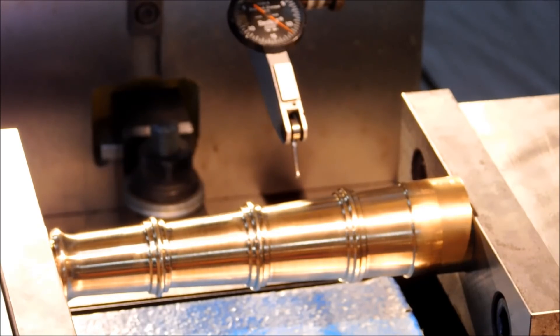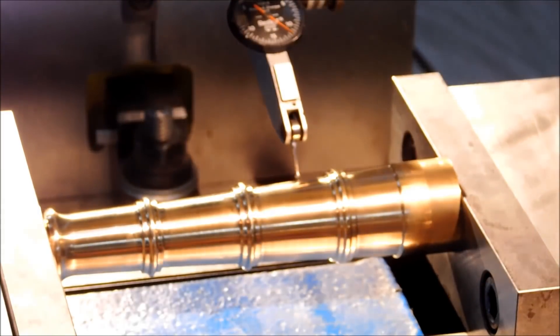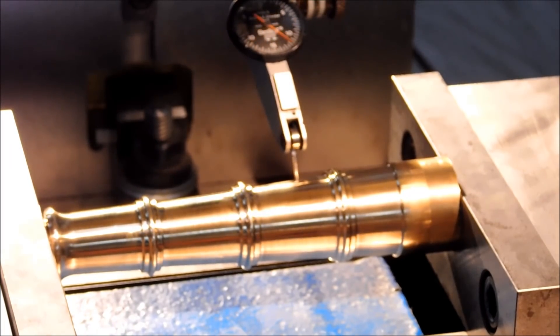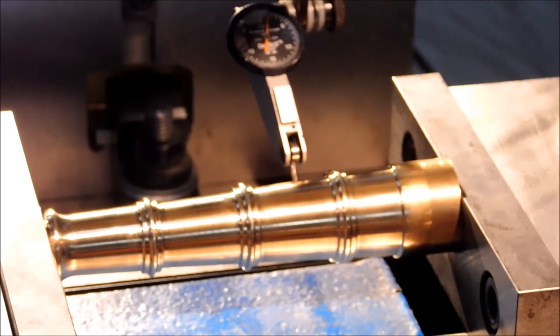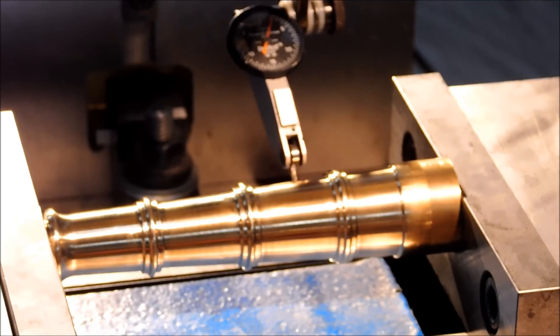Let's bring the indicator down and in and look for the vertical high spot. You'll see it show up — there you go. Try not to smash your indicator while you're doing it. Go down and up, look for the needle to peak out and come back. Right now we're sitting at about two and a half.